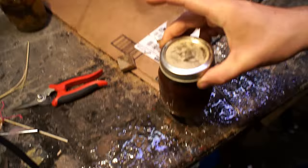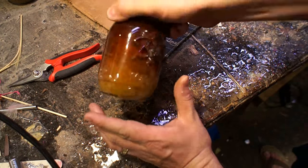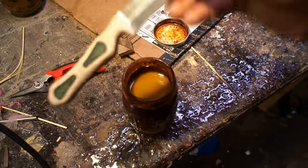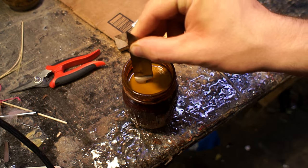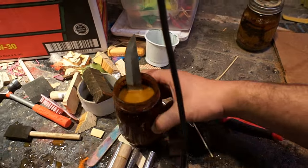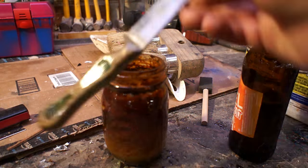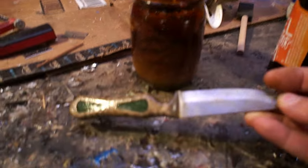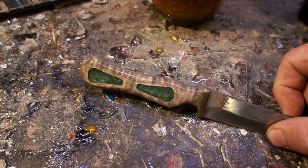The wood I'm using in here is a curly maple. Curly maple seems to have just the right amount of tannins in it where you can use this mixture and it'll bring out really cool color in it. It is apple cider vinegar and steel wool dissolved — it goes in and reacts with the tannins and darkens the wood chemically. I like this better than a stain because it really keeps the figuring of the wood and can intensify it. I wanted it to be darker to match that green color on the inside, and there you can really see how the figuring of the wood comes out.